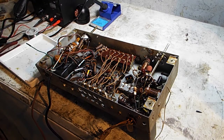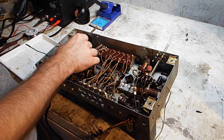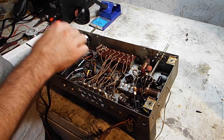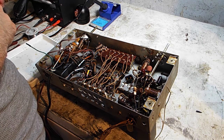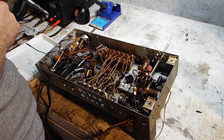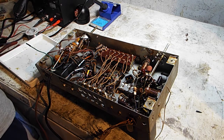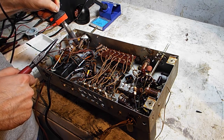All right. So I'm not sure if the camera recorded everything I said before, but what I did, I've already replaced these two capacitors. I'm just saying that in case my camera didn't catch everything I did before. The one capacitor was extremely bad. I hooked it up to my power supply, let it charge, and then switched it back, and it was only reading 0.3 volts when I had it charging at 4. So, yeah.